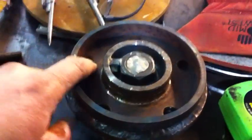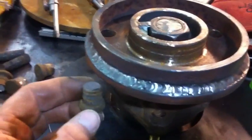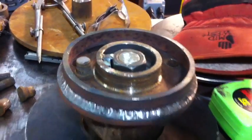I've unfolded the hub again. These holes in the top where the studs used to go for the wheels are going to create a great place for bees to live. So what I did is I took the wheel studs, threw them in the vise with a port-a-band, and cut the threads off — just leaving little stubs. I'm going to press those back into the holes so they create a seal from the bottom up and prevent any critters from getting in and making a home.